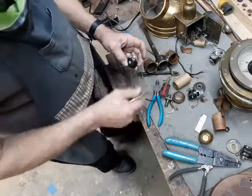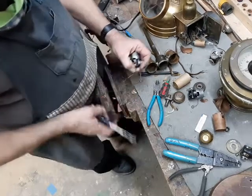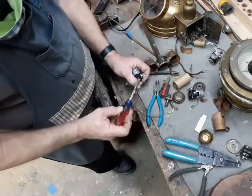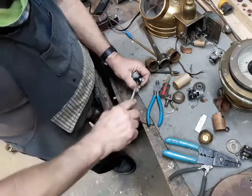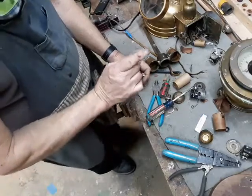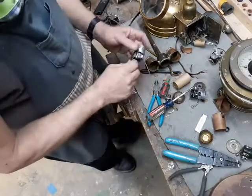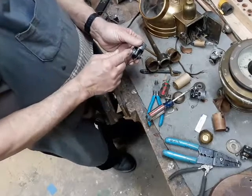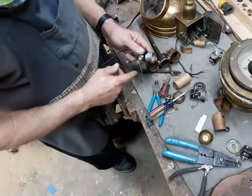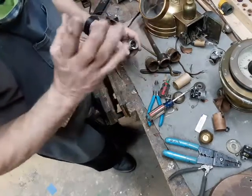The other wire — the one that is smooth — goes to this brass-colored screw. It goes to the terminal on the inside and through the switch first. In the United States, all our plugs have one wide terminal and one narrow terminal, and that's so you can only stick them in the outlet one way. That keeps these wires lined up on the correct screw, so that you won't electrocute yourself if you find a lamp that doesn't have a bulb in it, it's in the dark, you're reaching up and trying to turn it on, and you stick your finger in the light socket. Not good.